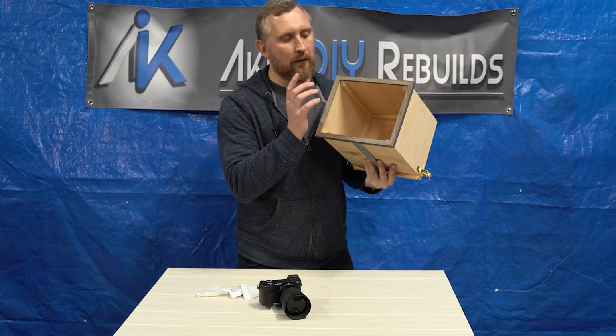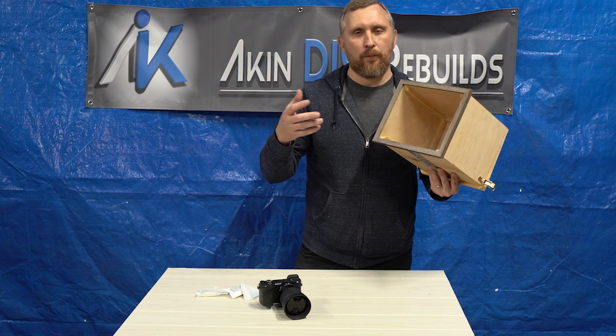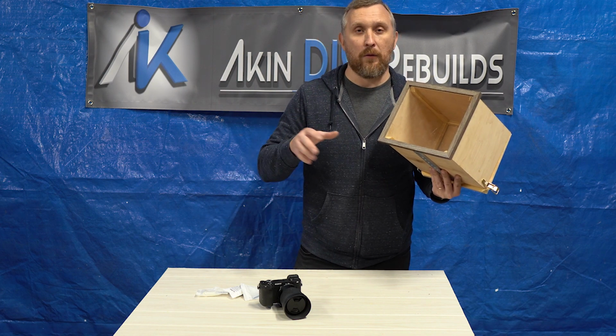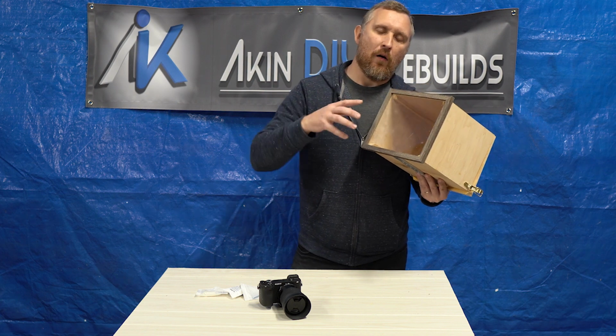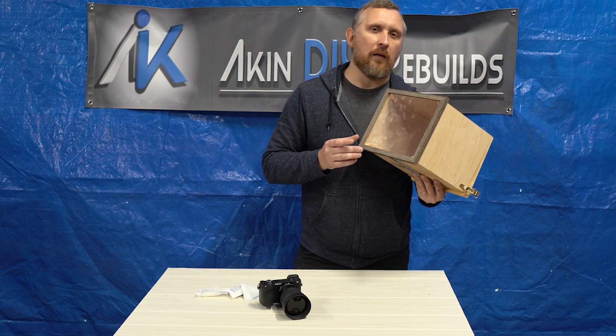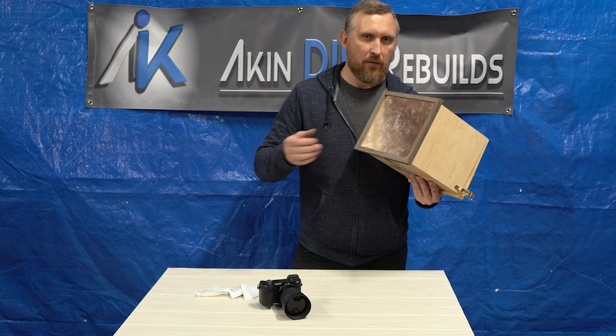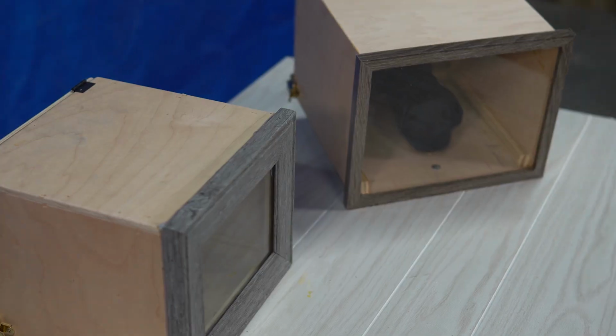The reason why I need a glass face is because when I'm spraying primer or painting, I will get a lot of overspray on the glass. And it's very easy to clean overspray from the glass. You just take a razor blade and scrape the overspray from the glass.